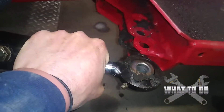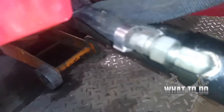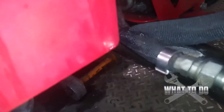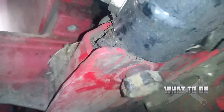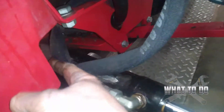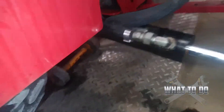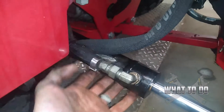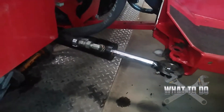Got the bolt out of there — that should free this up here. Now rather than take the hydraulic lines off right now, I think I'm going to remove that second bolt with my impact and pull this cylinder out a little bit more to give me clearance to get to that back hydraulic fitting, because I can't get to it right now. I want to remove that other bolt on the other end, pull the cylinder out a little bit, and then remove the hydraulic lines.